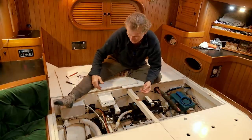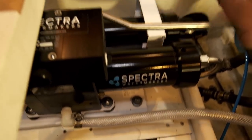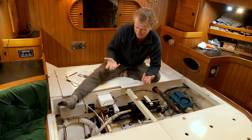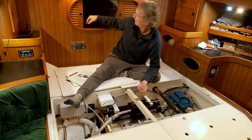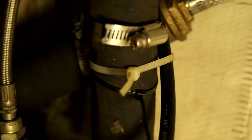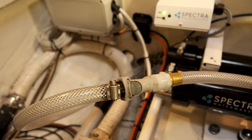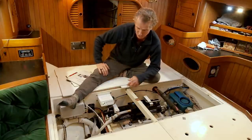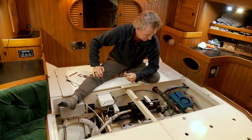We've got the brine outlet here — it can actually be taken from either side, and that needs to go to an outlet just above the waterline. We were very lucky because having removed the generator, there's a nice output where the generator exhaust used to be. They managed to get an adapter through it, so all the brine goes back through there. It's got a quick release on it too, so when servicing or adding chemicals, you just unplug it and use the provided tail end into a bucket.